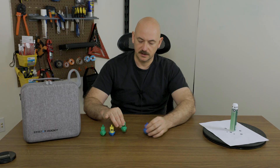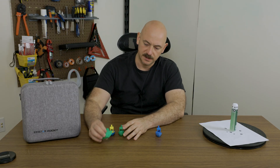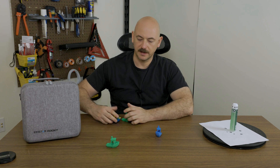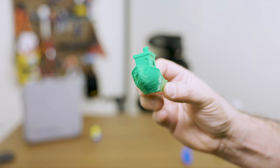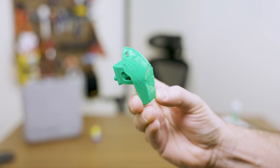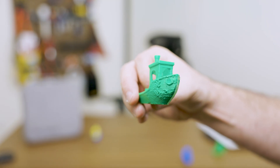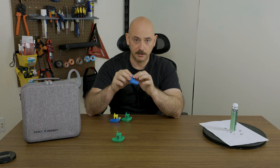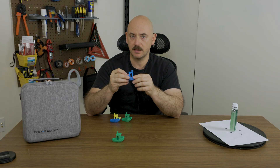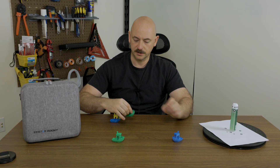The second thing I noticed is the surface finish was not great. On the first one that I printed, you can see there are some surface defects — it doesn't look great, and I wasn't able to get well inside underneath the roof compared to the one printed directly from the 3D model. But after reading online, I coated the Benchy in baby powder, put it in a little bag, shake-and-bake style. That cut down on some of the reflections, so I was actually able to get a smoother result.